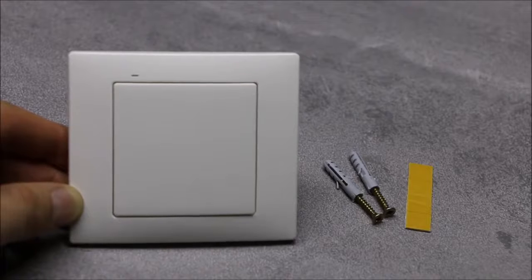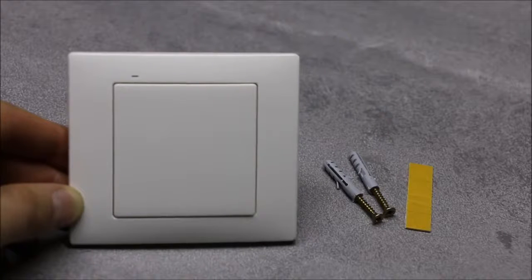The transmitter is designed for surface installing on virtually any surface. It can be easily installed on the wall, plasterboard, furniture boards, glass. Metal surfaces are the only exception. Installing on metal surfaces is not recommended, as it may significantly reduce the transmitter operating range.